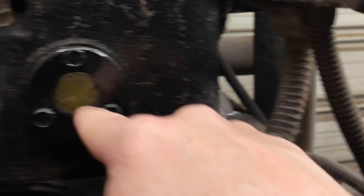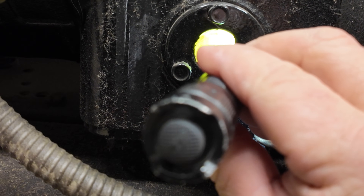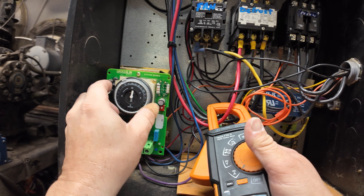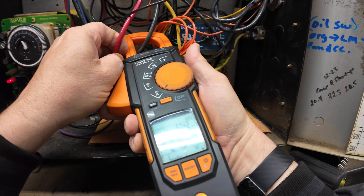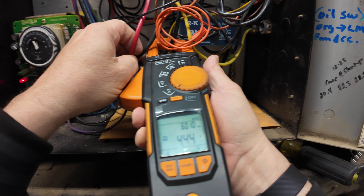As you can see we've got some flooding coming back because the system had been off for quite a while — that's generally what happens when you have refrigerant coming back in the oil. We're checking the amperage on all the defrost and amp draw at the compressors, basically checking everything and looking for something that could have caused our problem.